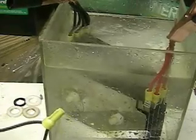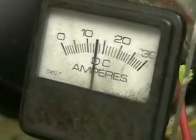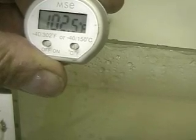Now we'll put the hot water in there. What you see on top are hot water bubbles, and now we turn it on. The water temperature is over a hundred degrees and we're drawing over 10 amps, almost 15 amps of current. It should be that the hotter the plates or the hotter the water, the more hydrogen we get out of it. Temperature is going up: 112, 114, 115.5, 116 — pretty steady at 116.